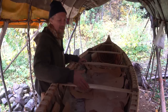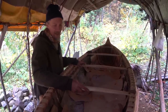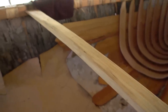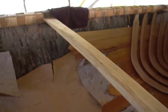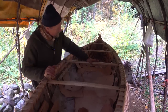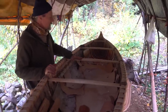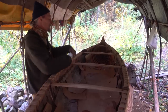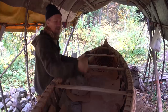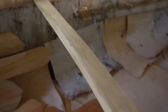And you carve them a little bit because you're going to be leaning back. This is what your back's going to lean on if you're sitting in this end. And they all got a little curve just so it's a little easier on your back. And it's nice to carve them like they're wide and thin, and then they get a little thicker and narrower. But that way the flex of them, the stress will be evenly distributed over the whole piece as opposed to having a weak spot.